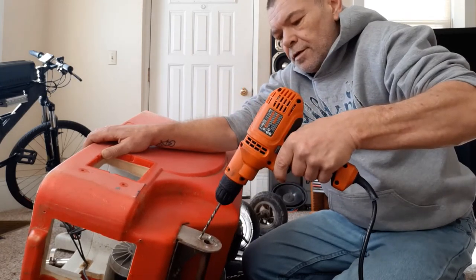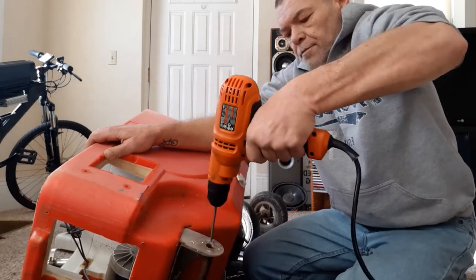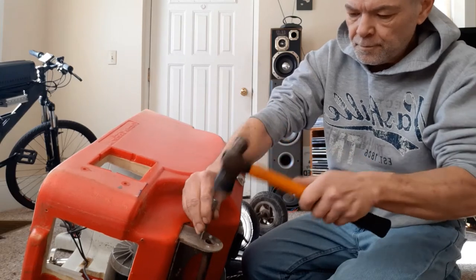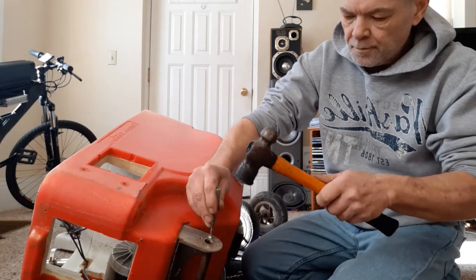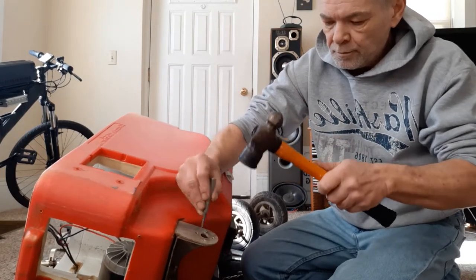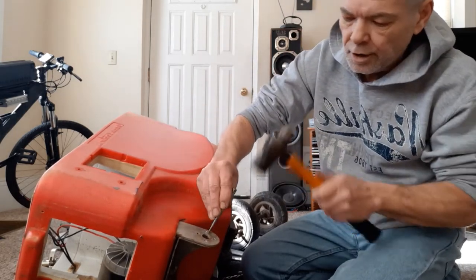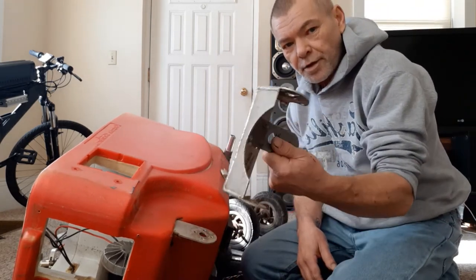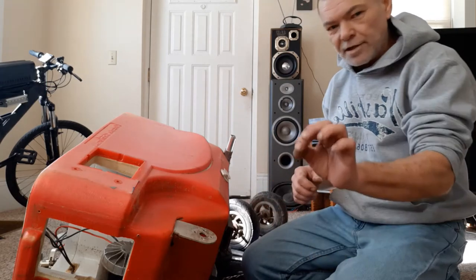There's a little persistent one. We'll just hit that one really hard with a hammer. You want it out — hit it harder. There. Now I can take it apart. I'll just replace those rivets with little cap screws and nuts. Good to go — a little Loctite. Good to go.